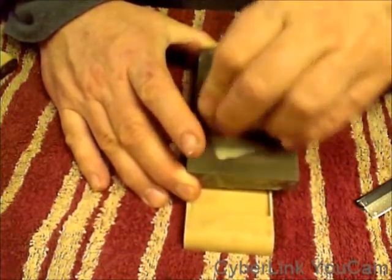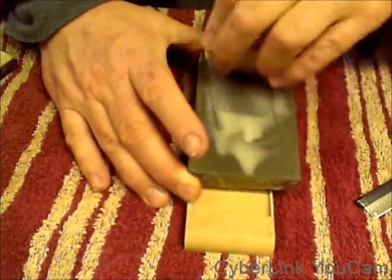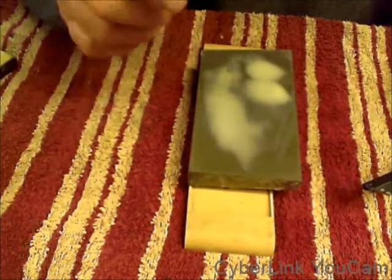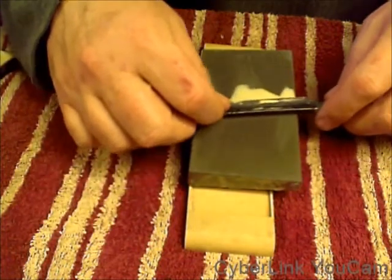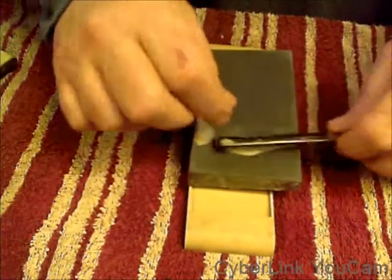And I believe in a heavy slurry. Now, sometimes you'll hear me call it thick, and I'm not talking about thick as in not having water in it. I mean a substantial slurry. I don't believe tiny little thin slurries make a lot of difference until you start getting toward the really close refinement of it. Now you see the difference in the color of that. See the creaminess of that slurry. It's different stones. Beautiful stuff.